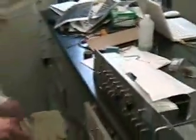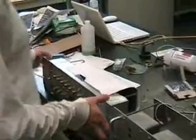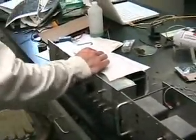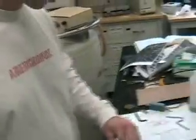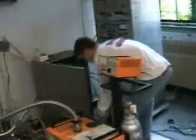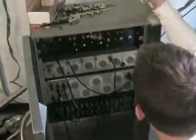Yeah, we need that to do the IV measurement. This is a current source — it has some amplifier inside but it's built like a current source box, so you can combine DC current and AC current from the lock-in. The lock-in is an AC current source too, but we will need another DC current source to measure the bias dependence.